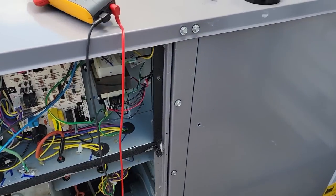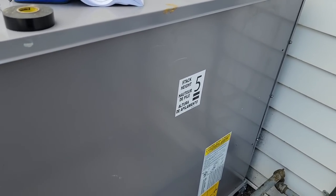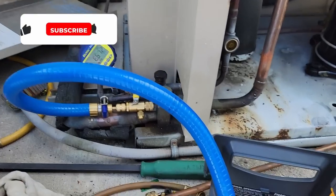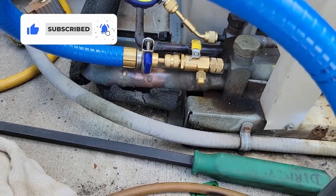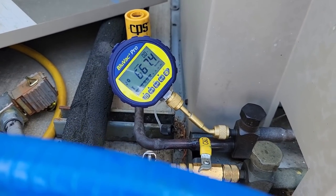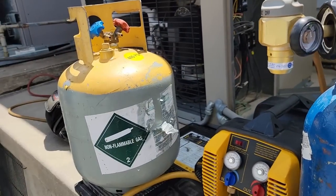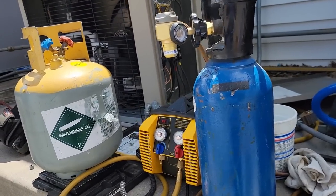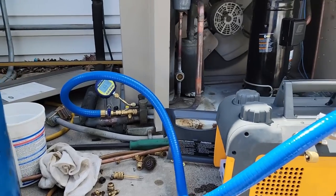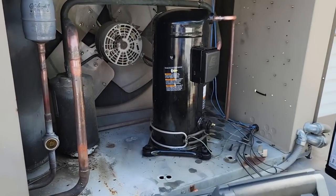It may go another turn yet on that fan and get that speed. I'd like to check static pressure and see where we're at on that. Jumping back over to this — we're at 660. We just valved off, we're not losing anything. I've smelled this a couple different times, it smells fine. I'm going to put the gauge on it, make sure PT chart matches up — it does.